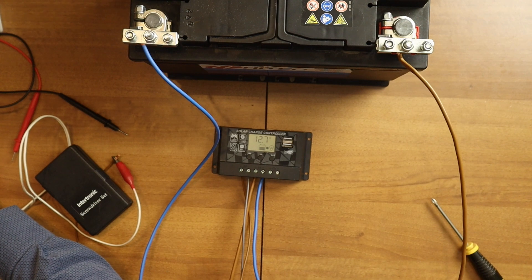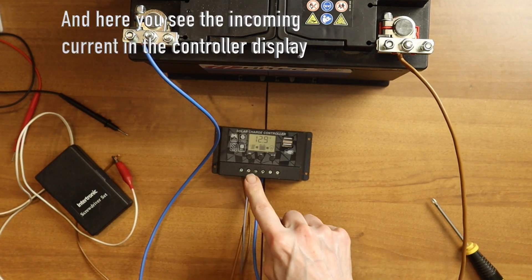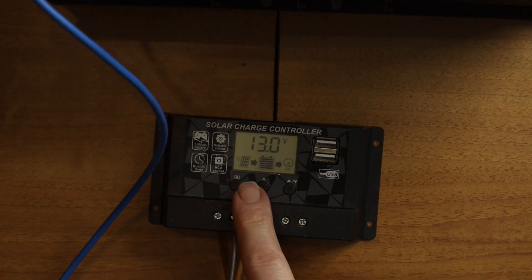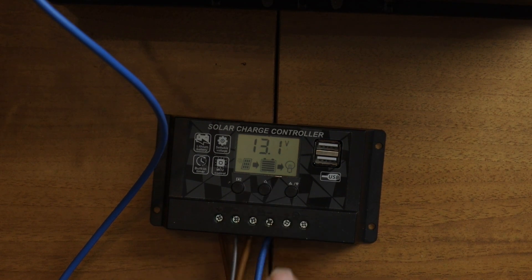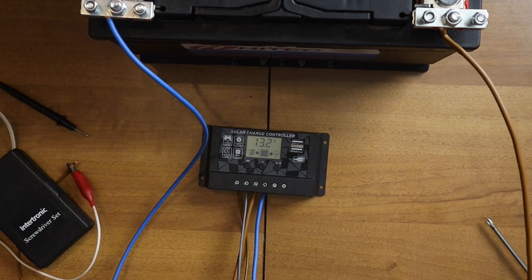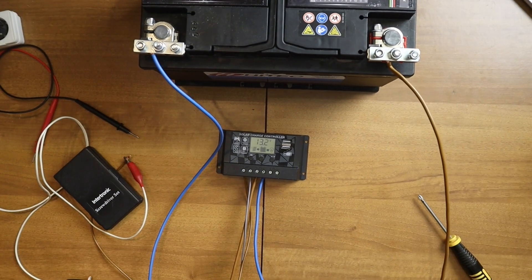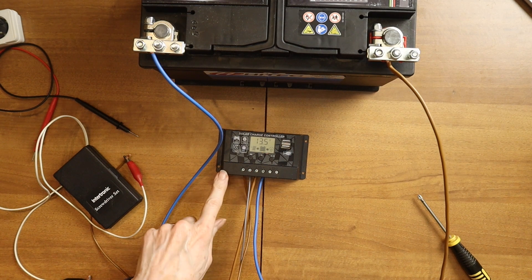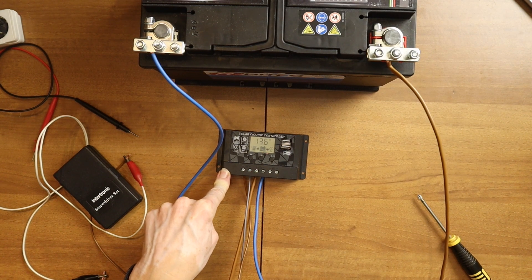It's charging. You can see the solar panel indicator. And you see this arrow in the manual — if it's constant on this arrow, it says it will charge quickly with high power. Indeed now it's charging with 3 ampere, which is the maximum of this power supply. The voltage here goes down to 13.7 volts. From 18 it goes down, and that voltage difference is not used in this PWM controller — it's just gone.